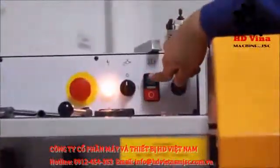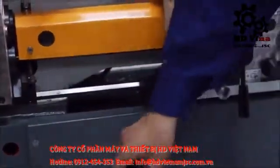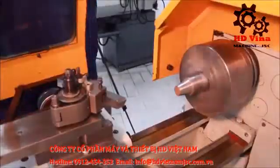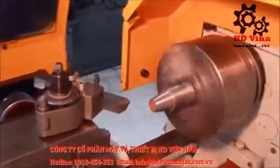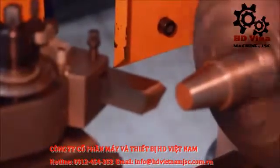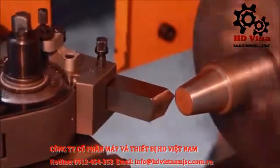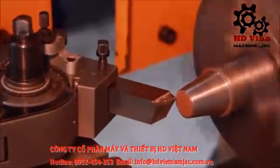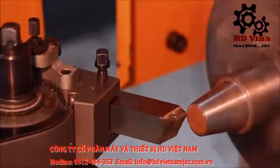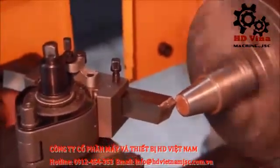Now we will turn on the lathe machine. I'm putting the machine into second gear. The tool has started to rotate. Now we will face the workpiece — make sure the glass window is in front of your face to prevent the hot chips. First we have to give it a slight touch so we can mark it as our reference point, which is zero. Gently rotate this dial over here — the slower it rotates, the better the finishing of the product.